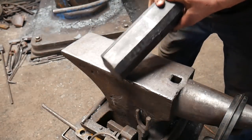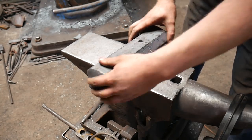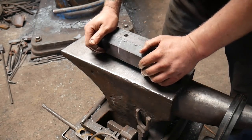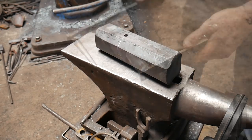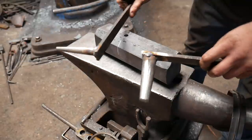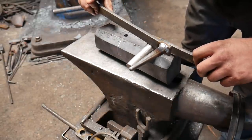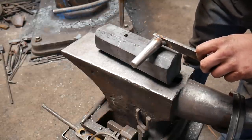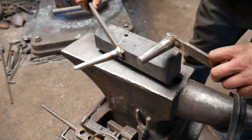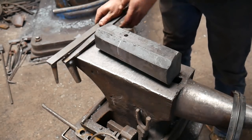Drilled all the way through. I'm quite happy as well, it was quite accurate. So what we're going to do now, I'm going to get this in the gas forge, get this nice and hot, and then I'll grab the tools we made. They're really rough. I will tidy these up at a later date, but these were the punch drifty thing that you will have seen Elliot doing just now. But we're going to drop these in, open this hole up until we can drop this one in. That's that end off there, and hopefully we'll be able to stretch the eye nicely.